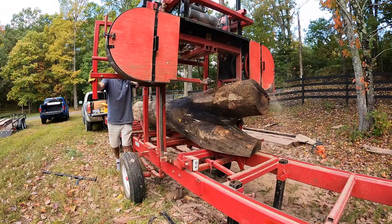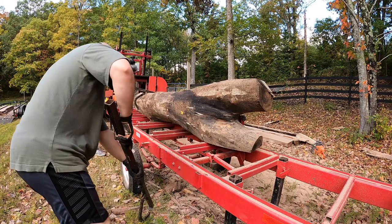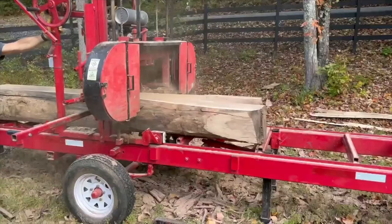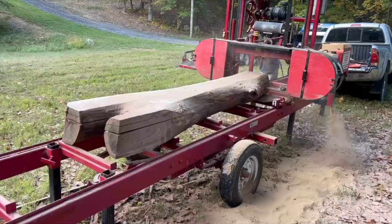We got it down to about 24 inches, which gives you about an inch and a half between each of the guide bearings to pass by the tree. Once it was narrow enough that we weren't going to have a problem with the guide bearings on the blade, we got it flat onto the sawmill. We took a nice pass off one side, rotated it 180 degrees, and slabbed it out every 2 inches so we have a nice live edge on either side of the slabs. In the end, we got about 6 slabs from this log, and I'm pretty happy with that.